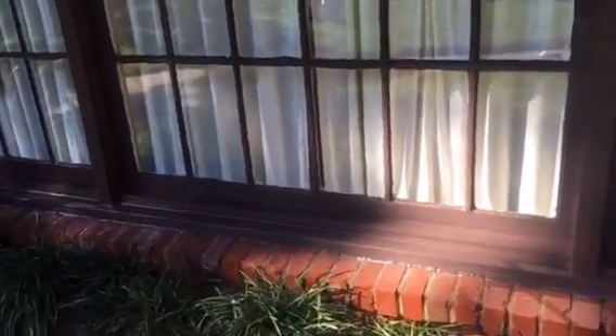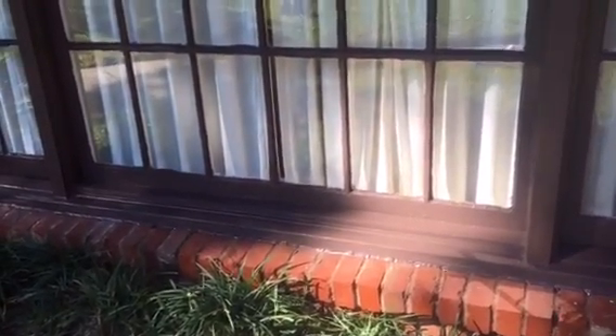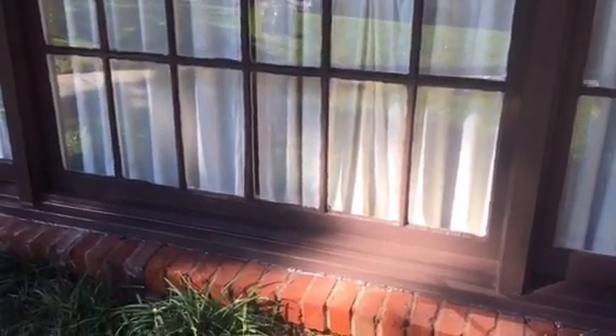Let me give you a quick rundown. If you go back and watch our other videos, you can see where all these windows were power washed, they were sanded, cleaned, primed, sanded, primed again, and now there's our first coat of paint on this one window. We will be putting a second coat also. We're going to spray it. This first coat is just to make sure I get good cut in around these windows, good cut in right here so that we seal all of this.